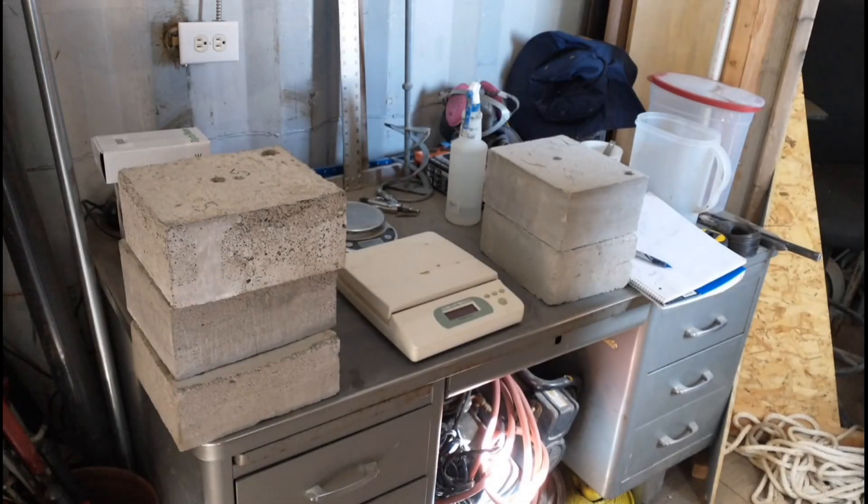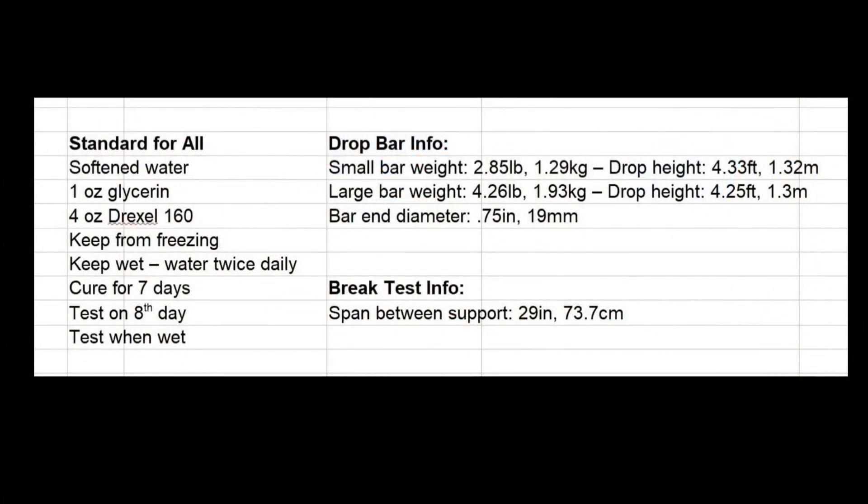Here we are moving on to dry testing of our first set of samples. We were really curious to see how drying the blocks out completely would change the characteristics. These samples were originally wet cured for a full seven days. The long bricks and smaller blocks were wet down and covered with plastic for another week, then set out to dry for several more weeks. If you haven't seen our previous two testing videos, I would recommend you watch those — link in the description.